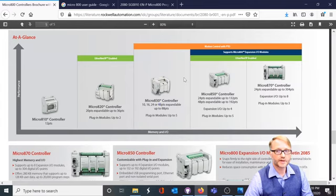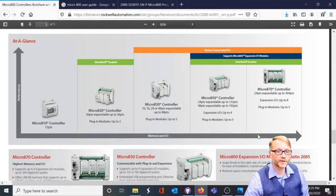From our previous meeting, you remember the discussion about points? There we said that the points of a PLC is the sum of the number of inputs and the number of outputs. In the lab, we had a Micro800 that had 24 points. Correction, it had 14 inputs and 10 outputs. One quick way to verify that was to look at the LEDs. So there were 14 LEDs for the input and 10 LEDs for the output.